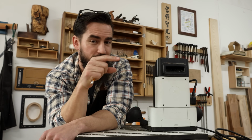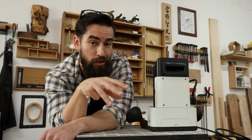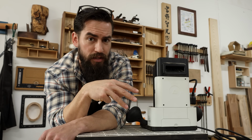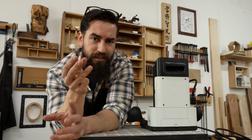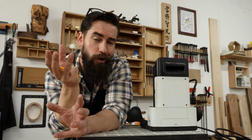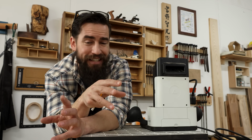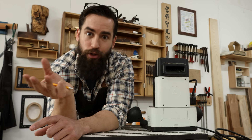The only difference on cutting it with this machine versus another method is, with this machine, I'm actually going to cut the tenon first and then cut my mortise second so that I can fit my mortise to my tenon, versus a more traditional way where I would cut my mortise and then fit my tenon to the piece. It's a flip-flopping, but the concept is exactly the same. You're going to fit one to the other to make sure that everything works together harmoniously. So that being said, let's do the stopped version with the origin, and then I will show you how to do the through version analog style.